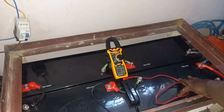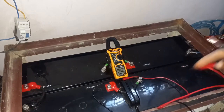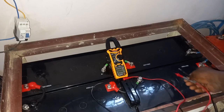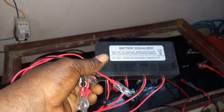So we have 12.93, 12.94, 12.85, and 12.92. You can see the voltage across the individual batteries differs. The function of the battery equalizer is to equalize them so that you do not over-discharge the battery. For this system I've been using it only during the day to power all my appliances at home, using these batteries because sometimes the sun goes down or there will be clouds.